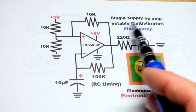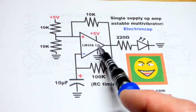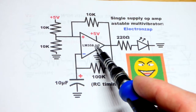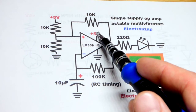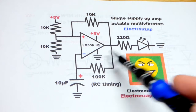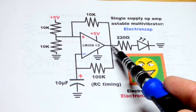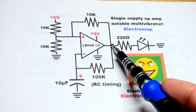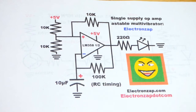In this video, we're going to use a single supply op-amp — the LM358. There are two of them in the integrated circuit, but we only need one. It's a single supply; we can use five volts positive and ground as the negative supply. Those four lines are all connected together, as are those other groups.